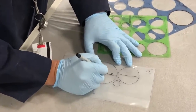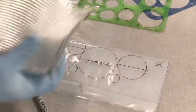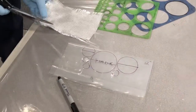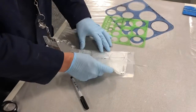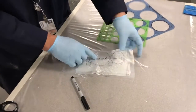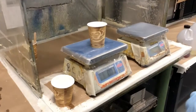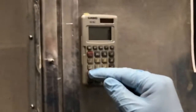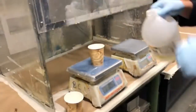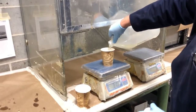Next, draw some straight lines on the big circle showing which way the warp fibers are going to go — very important. Then get some spare 10-ounce fiberglass, make sure the edge of the material is nice and clean. Now we're going to flip it upside down so we can't see our circles anymore. That way, when we wet it out and the material becomes completely transparent, we'll be able to see those circles and know that it's properly and fully wetted out.